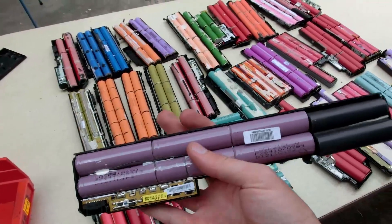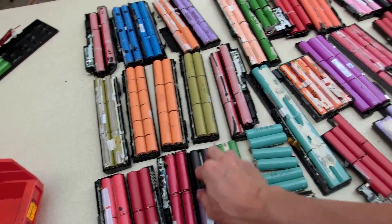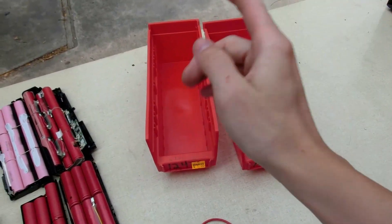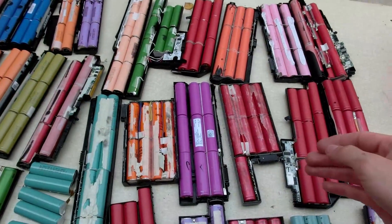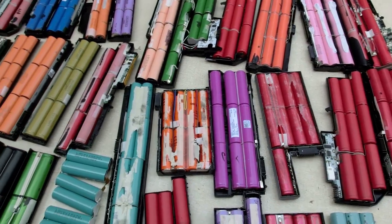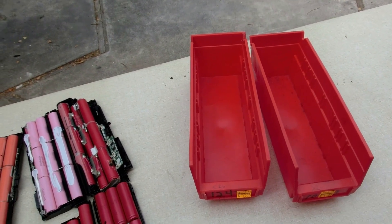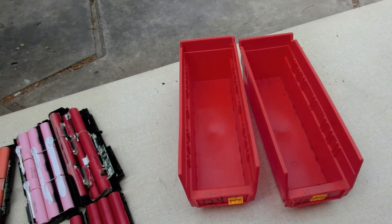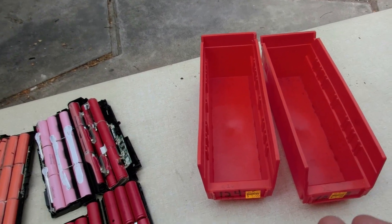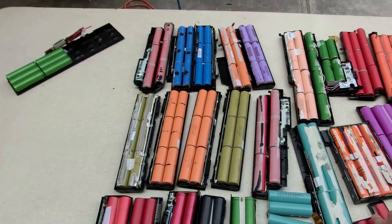Oh, here's a new color - it's like a brushed-out purple, with those stupid fake cells. So now what I'm going to do is start stripping down each battery pack and organizing them by less than one volt or more than one volt. Because if they're less than one volt there's a good chance that lithium dendrites have grown between the plates and could short circuit something in the future. Any cells lower than one volt I'll put into a bin for small project batteries, like flashlights. But if one cell like that fails in a big battery pack like in my electric car project, that's a huge issue - I want that to be more reliable. And if cells have no voltage at all, I'm not going to bother trying to revive them.